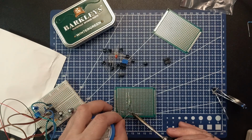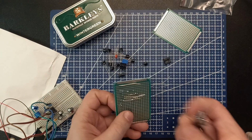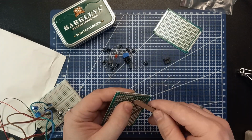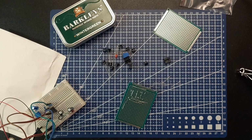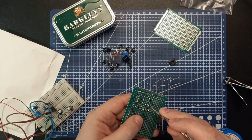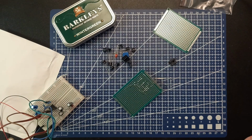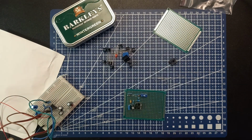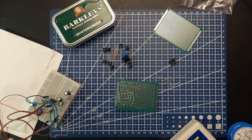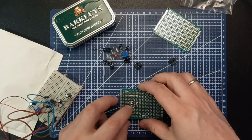The capacitance of the piezo sensor I am using for this project is about 10 nanofarads, so the input capacitor should be 10 times bigger, 100 nanofarads. The other two parts are the feedback capacitor and feedback resistor. Feedback capacitance together with sensor capacitance determines gain, and with feedback resistance determines the low cutoff frequency of the amplifier. At first, I thought of making a special PCB for this preamplifier, but it is much easier to assemble it all on a perf board, if I need to change or add any part.